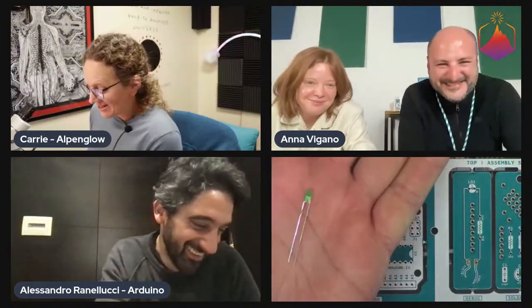The LED has a polarized pin. The long pin is positive. Yes, that is something I was going to mention when I got to soldering these. LED polarity is important, and they're easy to damage if you have to unsolder and resolder them, so it's worth a little extra time to get it right the first time. And I am notoriously bad at talking and getting polarity correct at the same time.